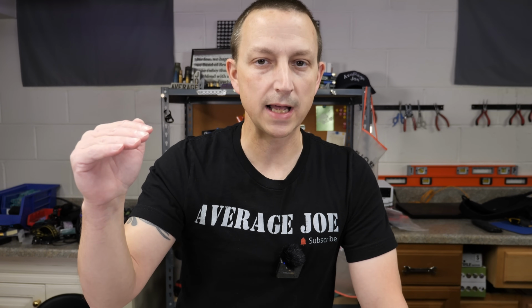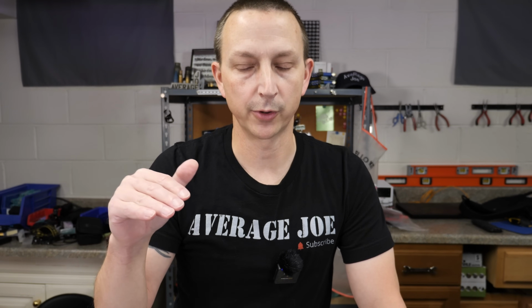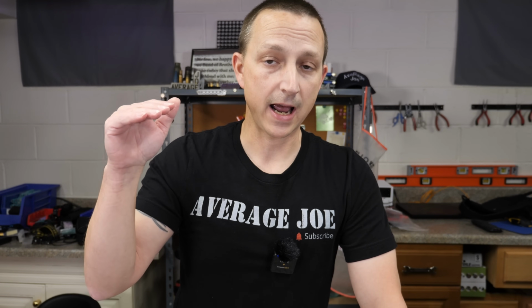The next things were the heaters, the saw, the air compressor, all of that kind of stuff. Whenever I ran all of the heaters, I think my max, continuous running watts were around, I'm gonna say, an average of 3,300 where it didn't shut off. If I started adding more than that, it would spike up to about 3,500 and then drop back down, and then shortly after that, the unit would trip out or at least shut off the inverter. It was easily resettable by just turning the inverter back on.